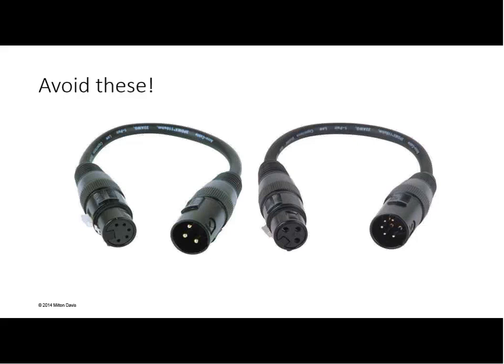Out on the stage areas, in the areas that are accessible to stagehands who see the rigors of daily plugging and activity, the reason is to ensure interoperability: if it's a 5-pin, if you plug it in, it should work, barring a couple of 5-pin stereo audio mics. If it fits, it should work. And that's about promoting the interoperability of being able to do that. There are some very good ruggedized RJ45 connectors, but if you're intermixing those, it really hurts the interoperability. And that is why we're really pushing that the stuff that's used day to day needs to be an XLR5. For the same reason, it's bad enough, as Milton points out, to have these 3-5, 5-3 adapters. Now adding to the mix a 5 to RJ45, an RJ45 to 5, an RJ45 to 3, a 3 to RJ45, it starts getting really painful really fast.